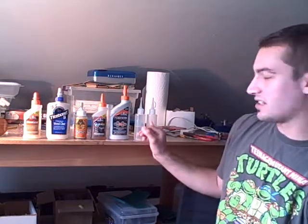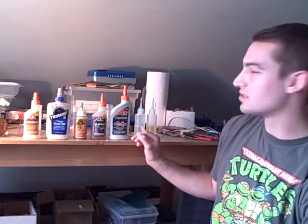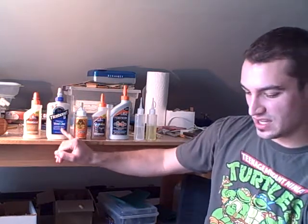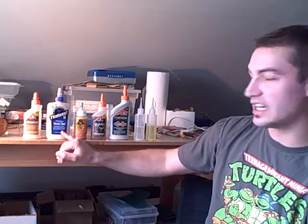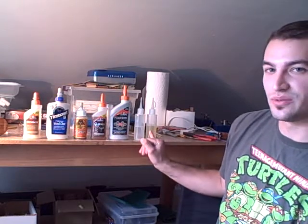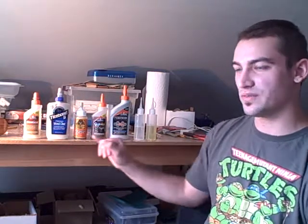But you might think epoxy is the strongest because that's what everybody thinks. But actually, according to that comparison and the testing they did at this university, Titebond 3, the Type 1 PVA, is actually the strongest glue. And then slow setting epoxy came in number 2, and then polyurethane came in last. Now, there wasn't too much of a difference between the strength, but it was almost significant. So the cheapest glue is actually the strongest. And I'll have that link below for you guys to check out. Do your research. It's interesting stuff.